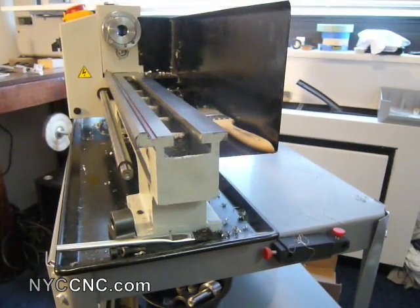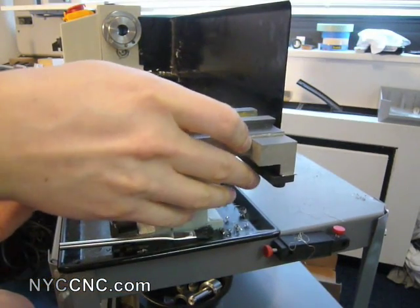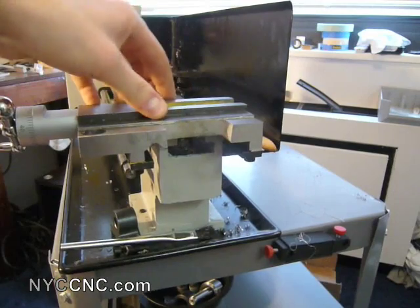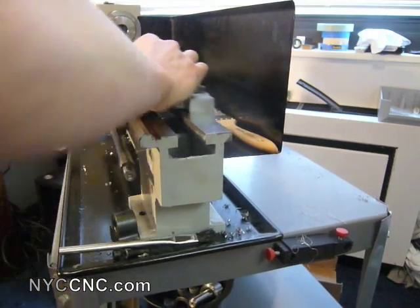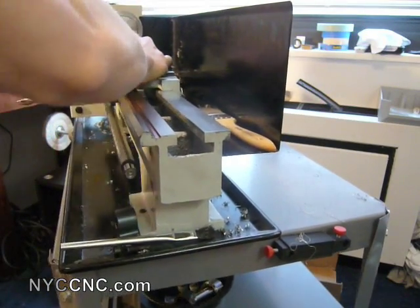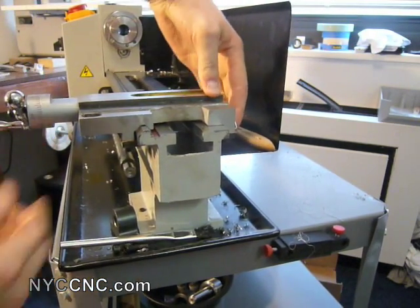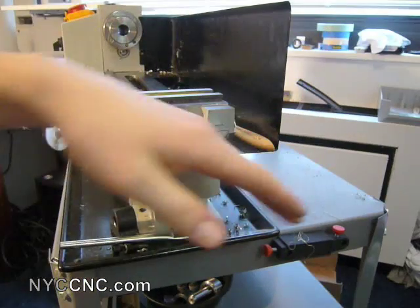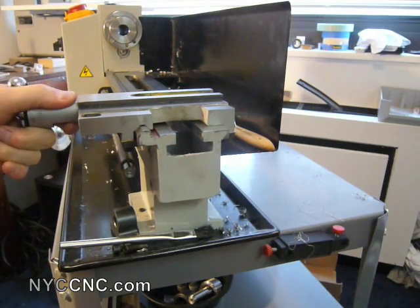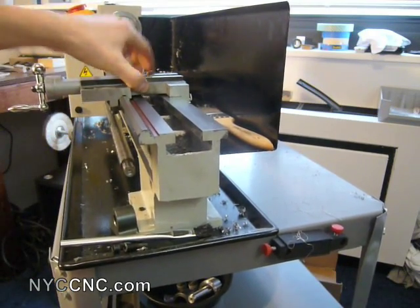Here's my lathe bed. I'll take this and slide it on. As you can see, it will slide. No oil on it right now. It's a little snug across the ways — actually interesting, a little bit snug. But what I'm happy about is there's really no movement allowing the carriage to rock on the ways, which is what I was trying to eliminate. So I'm going to go ahead and reassemble everything and see how this goes. Thanks, everyone.